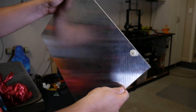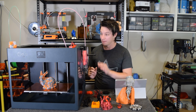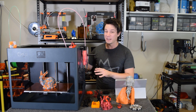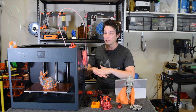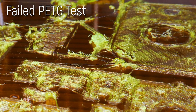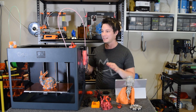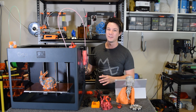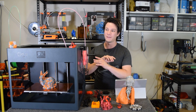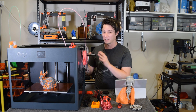This plate is massive — it's aluminium — and when you print PLA the bed could be 40 to 60 degrees Celsius, and you'll level it and prints will stick really well. But let's say you heat it to ABS temperatures, 100 degrees on the bed if not higher. Well, that aluminium thermally expands and physically becomes closer to the nozzle, and in my tests this means it can actually collide and ruin that first layer and damage the PEI sheet. You could just level at the temperature you intend to print with, but you don't want to get too close to a 100 degree aluminium plate. I think it's really important that there's consideration for an automatic mesh levelling system just before the print commences, and at this price point I would like to see that implemented.